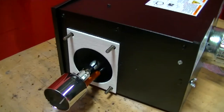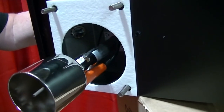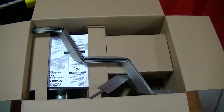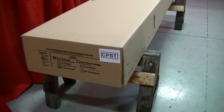It is important to note that the CTH2D burner has external mounting studs. Other Roberts Gordon unitary heaters may have separate bolts to attach the burner to the burner tube. A 36-inch long flexible gas line is included in the burner carton for US customers; it is sold separately for Canadian customers. The burner carton also contains the burner tube gasket, hex nuts, lock washers, pipe nipple, and turbulator for select rates.